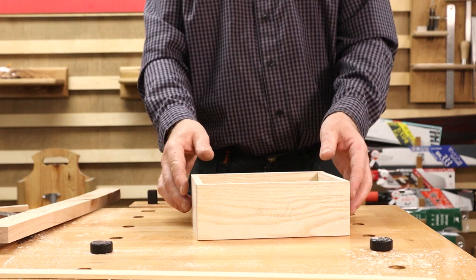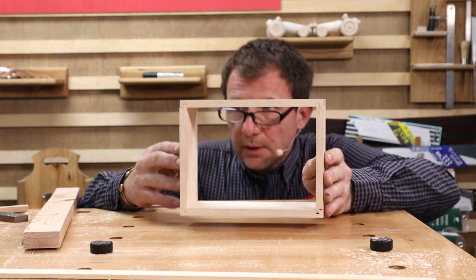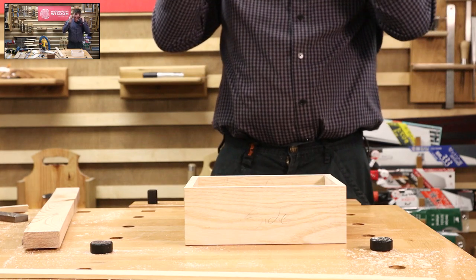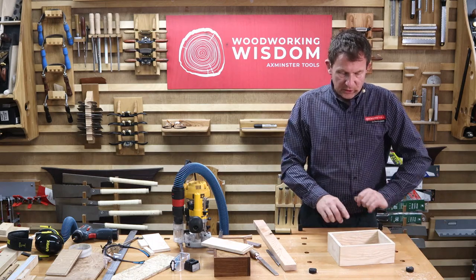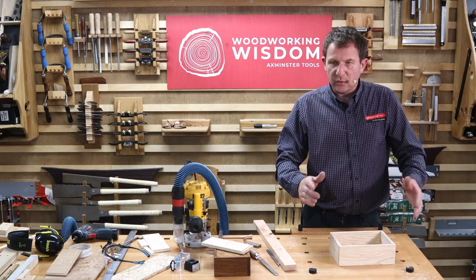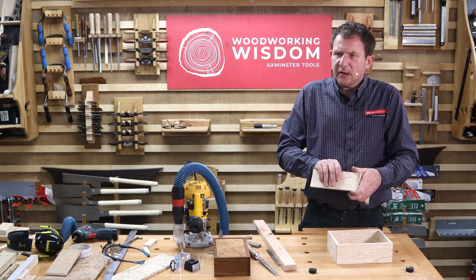So, hopefully, not bad, we end up, you can have a cube, you can have a tally, okay? So, you end up with your box frame, alright? That's the first bit, alright? Get those little halving joints done. Next few sessions we're going to look at doing the routed groove, fit the lid and the base, the cutting, all the other little bits. But the first bit there takes a little bit, get that joint right. Last few bits in there, a bit frustrating.